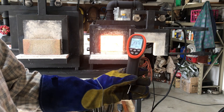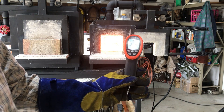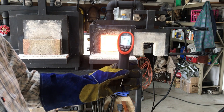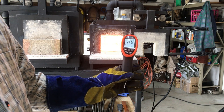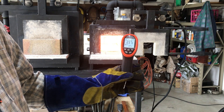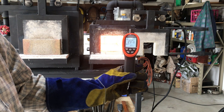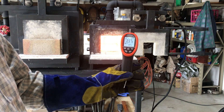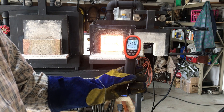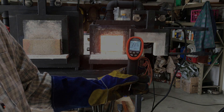Right now it's 2,378 degrees and it's still climbing. It's been heating up for 15 to 20 minutes, so you can see the small one gets up to temperature much quicker. Now the bigger one will also get up to 2,400 plus, it just takes longer. This particular small forge, because of less mass and volume, is getting up to temperature a lot quicker.